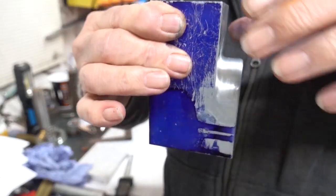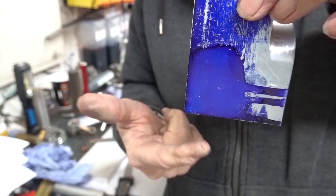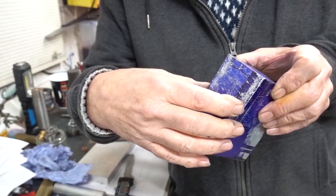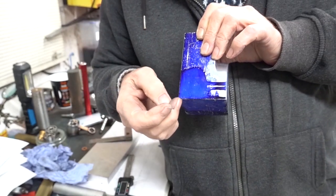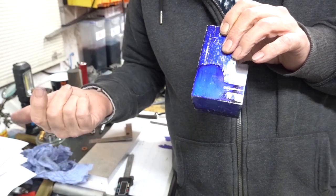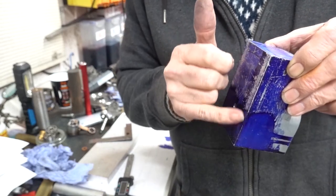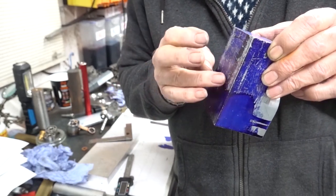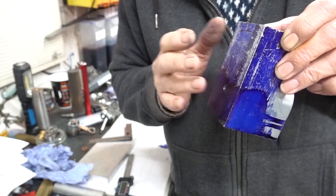That detail's done, but we need to do the same detail as that there, and that'll be where the cylinder head goes. I'm very close to where the cylinder head's going to go on there, so that wants to be rounded, but only for, I've worked out, three quarters of an inch. The David Kurzel drawings, I think they're three quarters of an inch, but that allowed for a boss sticking out at the front. I don't want a boss sticking out of the front. My head's going to clamp onto there, although the cast iron barrel will stick out a little bit, with a recess for a seal.